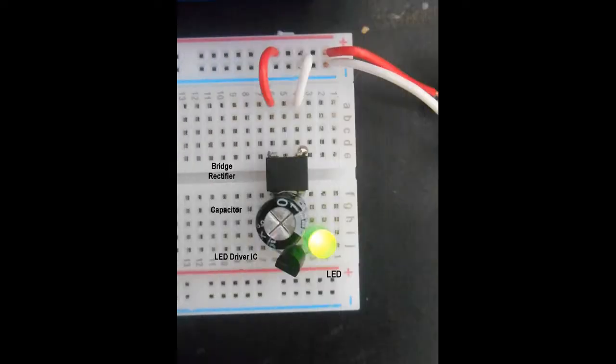Here is a set up on a breadboard showing a green lit LED. Up to three LEDs can be added. If placed in series, the combined forward voltage of the LEDs would limit when the LEDs light. If placed in parallel however, a lower voltage threshold will light the LEDs. This is preferred in lighting rolling stock. For static structures such as buildings, the in-series arrangement can be used.